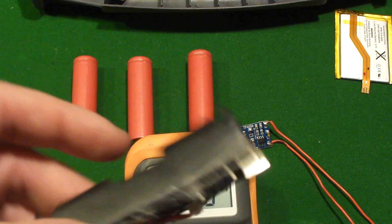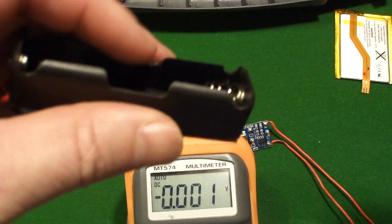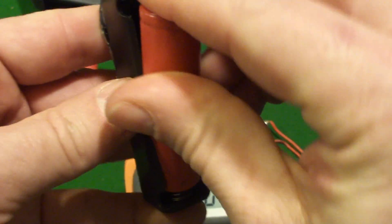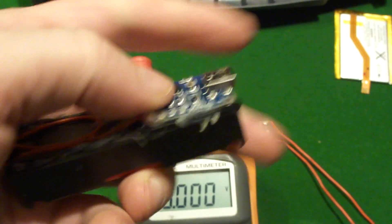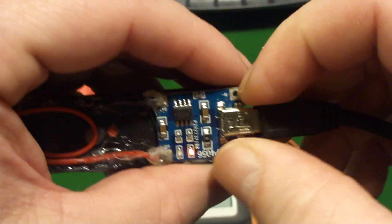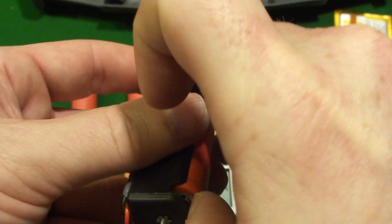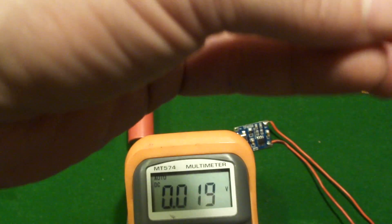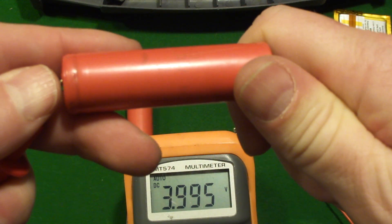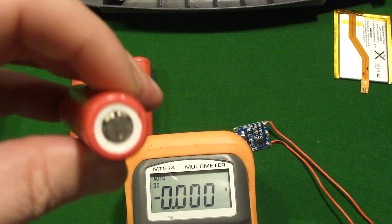I've got one here all mounted into a single unit — there's a TP4056, all good to go. The little groove always indicates positive on these batteries, and most things, the spring is on negative. So we put that in there, and I'll shade this a little so you can see the LED. We get power in and you can see a little red light turns on — that red light means it's charging. Beside it is a blue light that will go blue when fully charged. This battery's got a pretty good charge in it, so we'll connect this to the multimeter — it's reading 3.995 volts. When fully charged they'll give about 4.1 volts, but once put under load they usually drop to about 3.7.